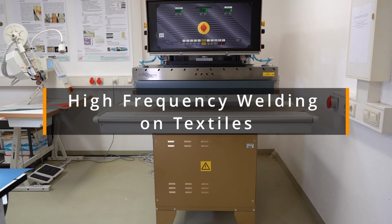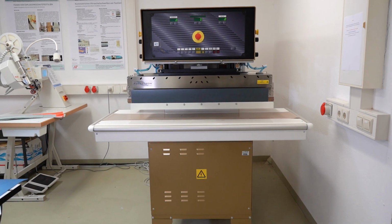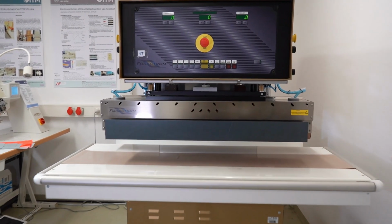Welcome to this tutorial video of high frequency welding on textiles. High frequency welding is also known as radio frequency welding. It uses electromagnetic energy to heat and bond the thermoplastic materials, and the molecules in the fabric heat up, melt, and fuse together under pressure.